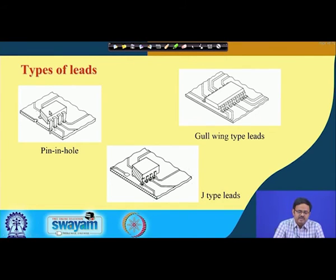To trace the full connection path: contact points on the silicon are connected via wire bonds to leads on the lead frame, and those leads go into pin-in-hole or through-hole connections in the motherboard, completing the connection to the wiring traces inside the motherboard. Pin-in-hole is a common and important lead arrangement.